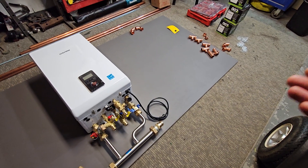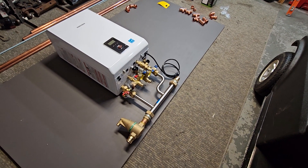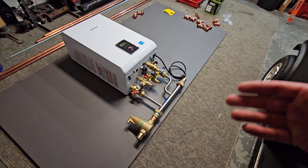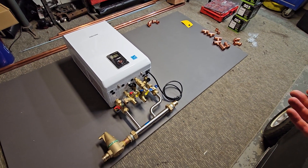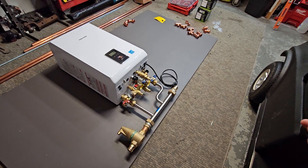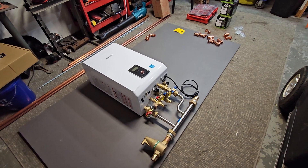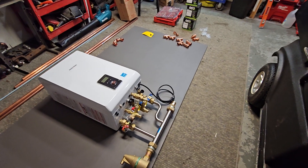It's really those existing systems where the savings shine. I deal with people all the time who have a 50-year-old or 30-year-old boiler in their basement that's still just chugging along — the benefits from changing over some of this will be tremendous. There are other options I offer as well, such as upgraded circulators which will additionally save you more. There are different options as far as ECM circulators or variable speed circulators. But what I like to do is get all your inputs, talk to you specifically about what you want and what your goals are, and then build a system specifically for that. If you don't have a major budget and you don't want to blow all your money on what I call the Cadillac of boiler systems, we're still able to build a system to meet your needs and save you money long term.